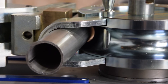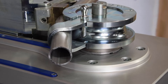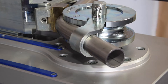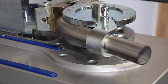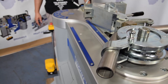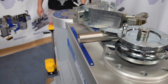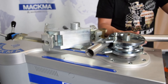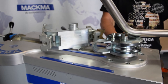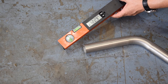Let's see how to bend. Now we go back to zero. We reached our 90 degrees without springback, and with the full pedal I push back. Now I remove the pipe — still without springback — so we can measure the angle. As you can see it's not 90 degrees because we haven't inserted the springback value. It measures 122.9 degrees, which means around 33 degrees of springback.